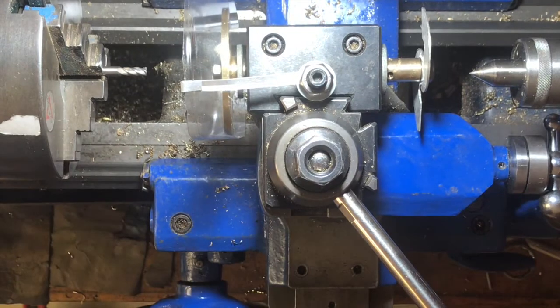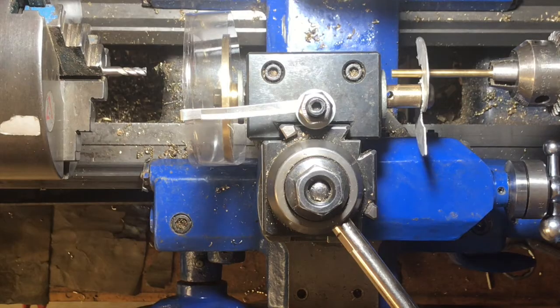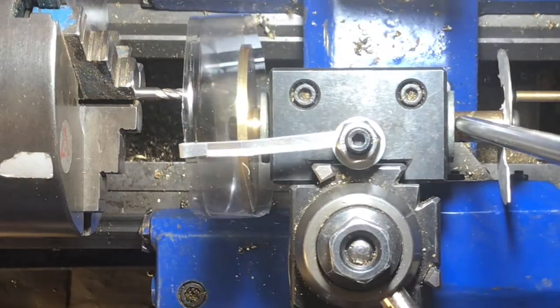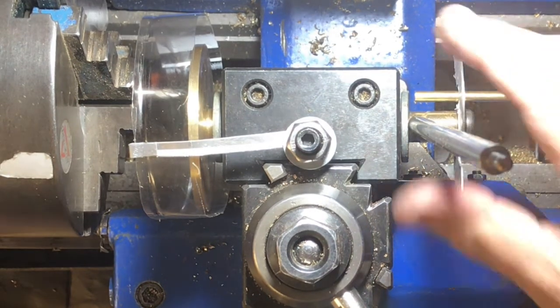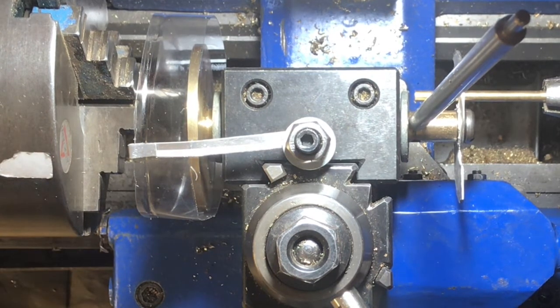There's a little bit of aluminum scrap holding the Coke bottle sleeve in place, and inside you can see the brass disc I'm going to be cutting. That reminds me to put on my earmuffs and close-up glasses — eye protection and even a surgeon's mask. We'll see if it makes as much dust as I'm expecting. Let's move the cross slide back until we can get the follower into the base of the S-shape. I'm going to use this bar in the hole to rotate the pattern. The lathe is set on position four — 900 RPM — and I'm using a six millimeter end mill.